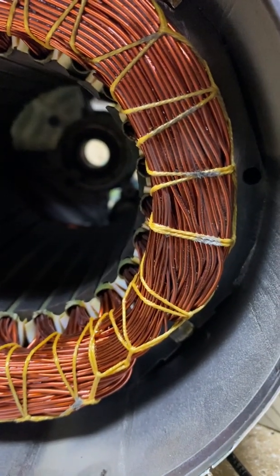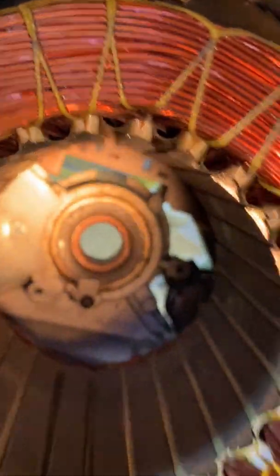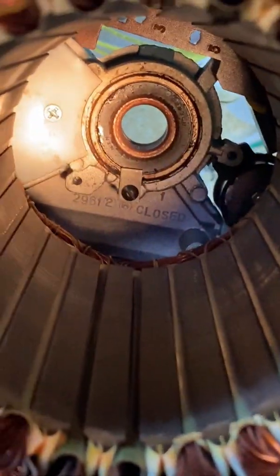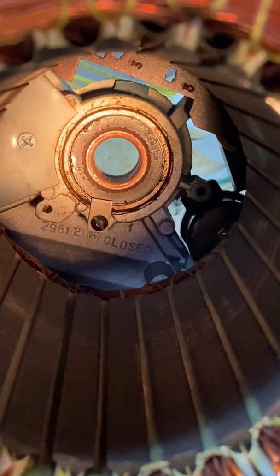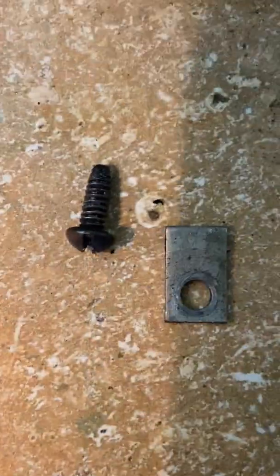You can't see it — I'll get a light and come back. With a light, you can see the bearing in the top end of this motor. There's a little screw holding a retainer clip. I'm going to try to carefully remove that screw and retainer clip to see if that bearing will slide out without having to take the top off. If necessary, we'll take the top off. I removed the screw and the retaining clip with a pair of needle nose pliers. Now let's see if we can get that bearing out of there.